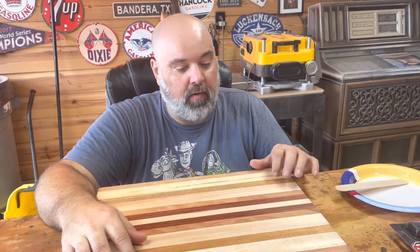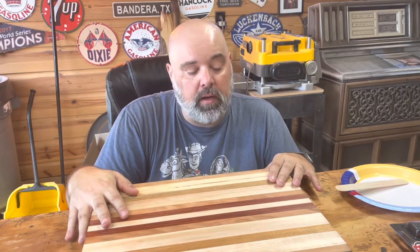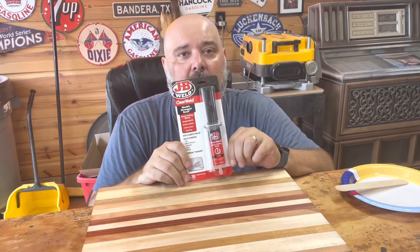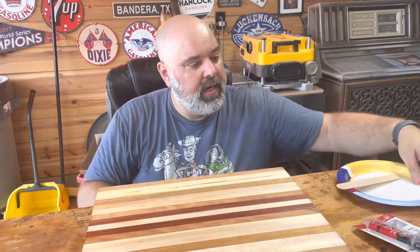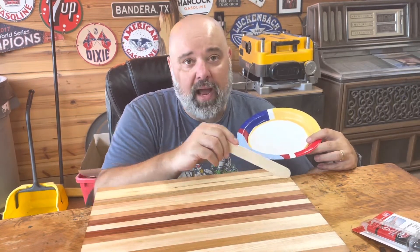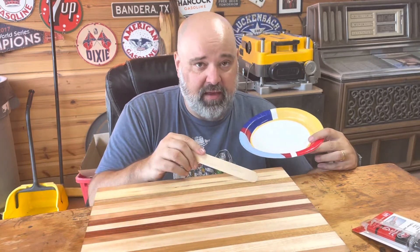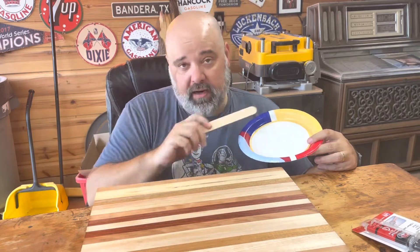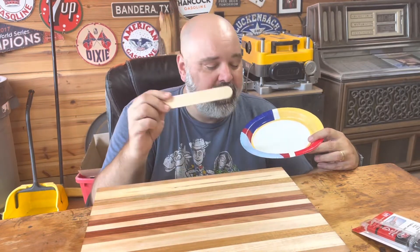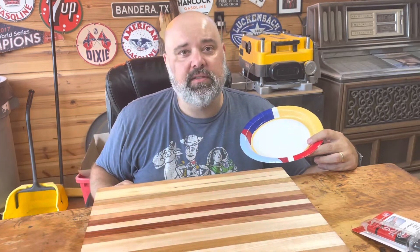I'm not going to be able to fill in this crack with glue or put it back together or anything like that. Just keeping the board oiled will keep it from cracking anymore. But what we can do is put kind of a permanent patch on these cracks. What I've got here is some clear epoxy — two-part epoxy. I'm going to mix this up; it's the epoxy part and then there's a hardener. Mix it up and then I'm going to try to fill up these cracks with the epoxy. This stuff sets up in about five minutes and dries in about an hour or two. We're going to glob it on pretty thick because once it's done hardening, you just come back, hit it with a sander, and make it smooth again. It's just going to fill in those cracks so we don't get food stuck in there and grow bacteria — we don't want any of that. Once we get that done, we're going to sand it down, run it through the router, clean up these edges, and then it's on to the next step.